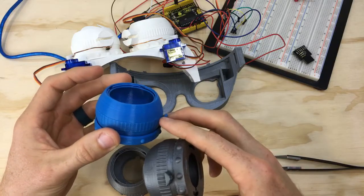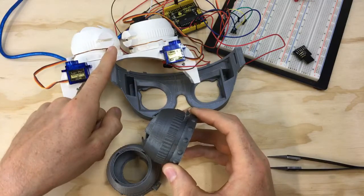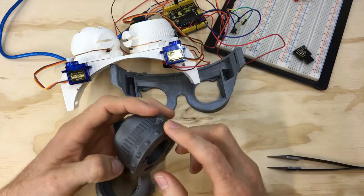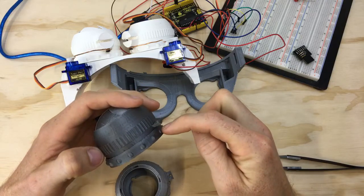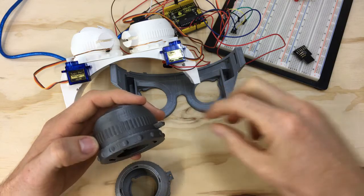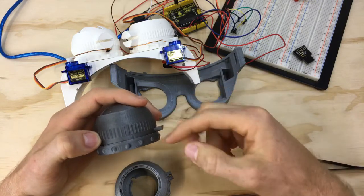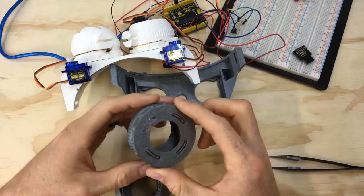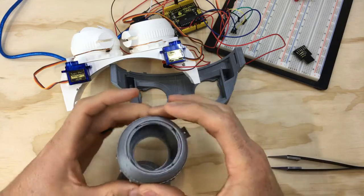You can still spin this without breaking it off — unlike the blue ones where the arm was super fragile and you could hardly move it. These are still very strong, just not overkill. In the design I have a little column that prints right there so you don't even have to mess with supports. You just drop it down and print, then when you're ready to assemble you drill from that side and it breaks off the column, or you can snip it.